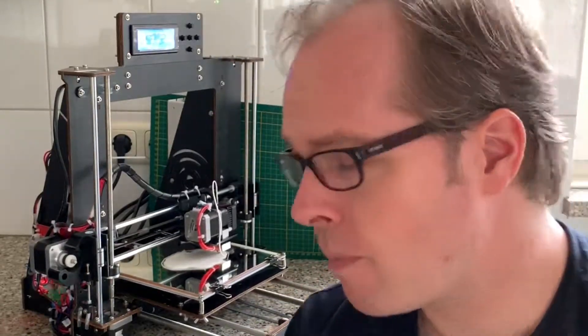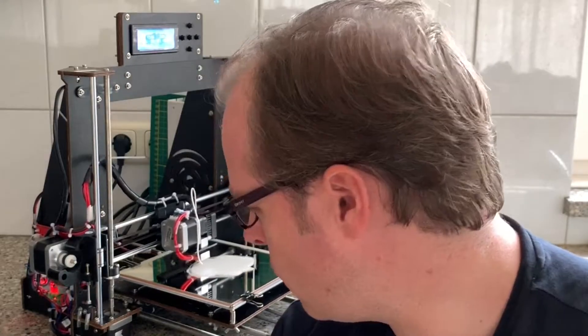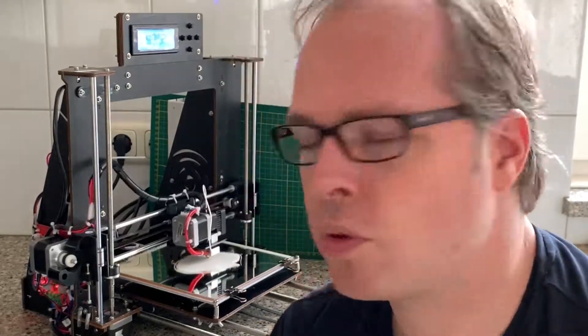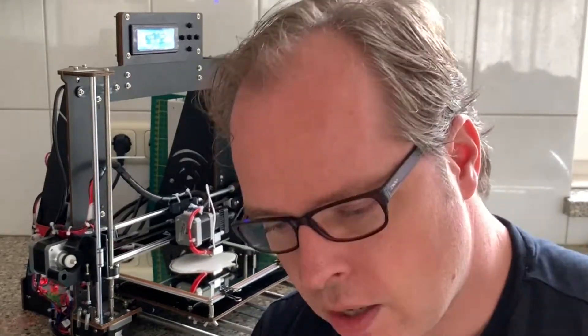When you are going to buy this glass, the pack I bought was 30 centimeters by 30 centimeters. This printer has a print bed a little bit over 20 centimeters in width and length. Make sure when you are cutting the mirror that you also take notice of the screws on the edges. Try to cut the glass plate to 20 by 20 centimeters.